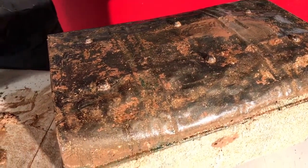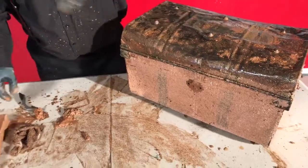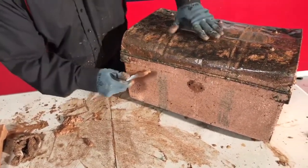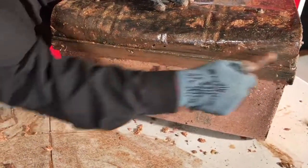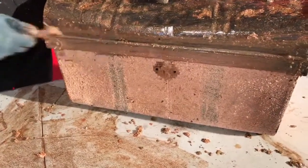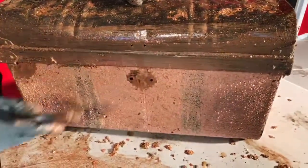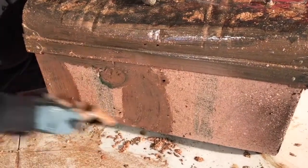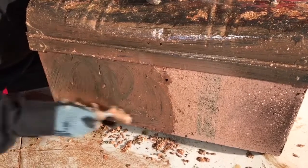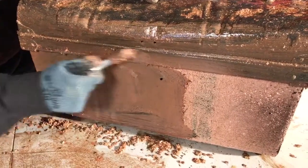And again, twist that around. So I'm wearing these rubber gloves, not the kitchen ones. The stripper itself is pretty close to being pH neutral, so it's not an aggressive stripper. If you buy your typical gel type ones, if you get it on your skin, it'll take your skin off as well. This won't. You do need to take care. I mean, it's got a job to do. But it's not harsh. When I made it originally, I had actually personally suffered major chemical burns from normal products, so I was very mindful of not wanting something to do the same.